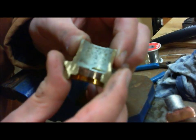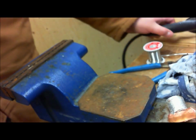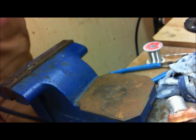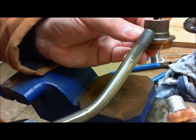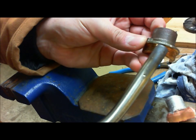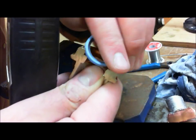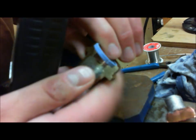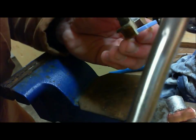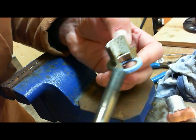All right. So with that being said, we want to make sure that when we have the ball valve in position, our tip here is going to be applying heat as low as we can without burning the seats, because if we flip this over, the Teflon seat sits just like this. So imagine now this is the inside of the chamber, and we're putting heat right along here.